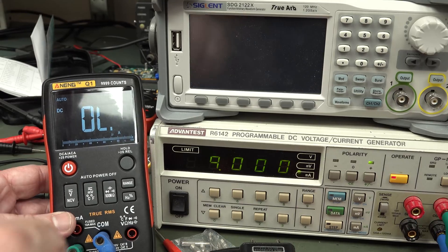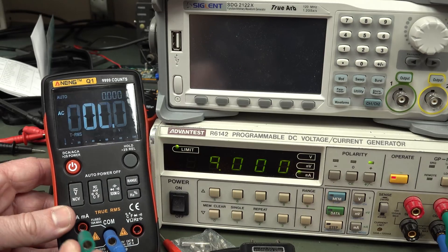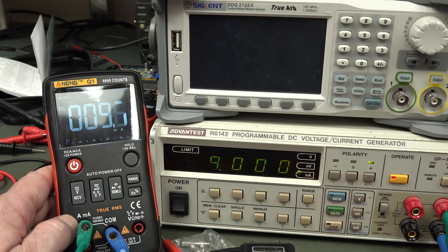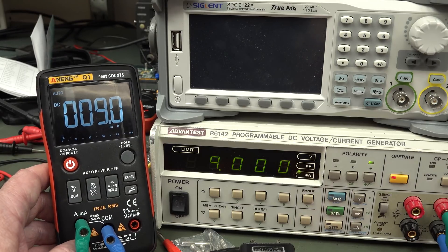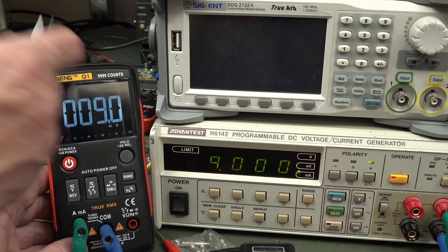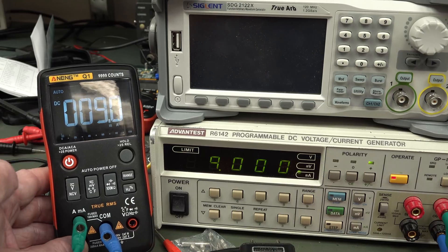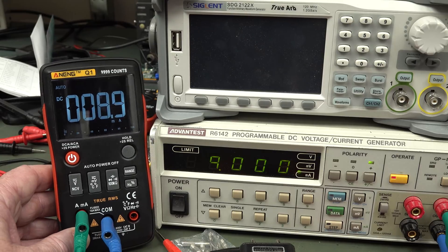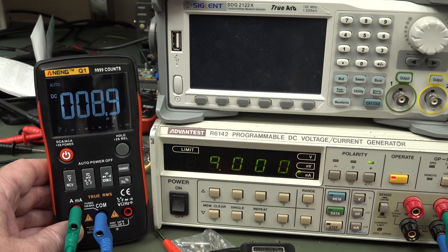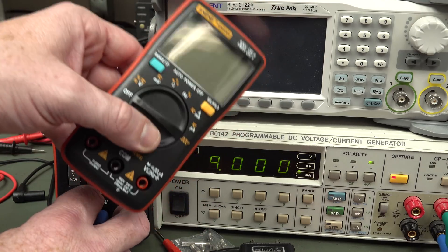For current microamps, that's not too shabby at all. But here's your problem: if you want to measure nine milliamps, forget it. Put it in the milliamps jack up here — but look, you've got like one digit. It's crap — measuring something you'd measure in everyday electronics, you don't get any resolution at all. That's a huge downside. It misses the 100 milliamp and 10 milliamp ranges. It's inexcusable. If this is your only meter, do not get either this one or the 8008.